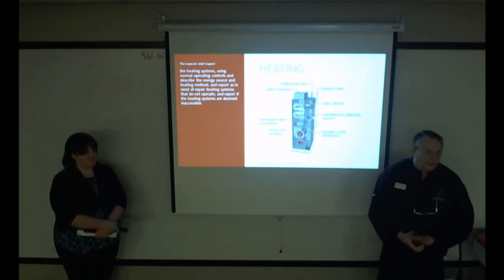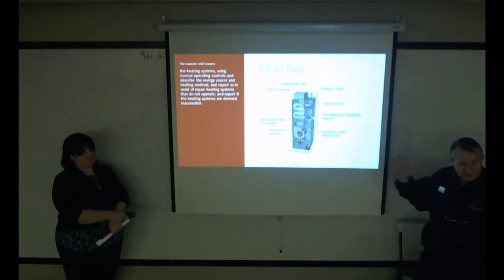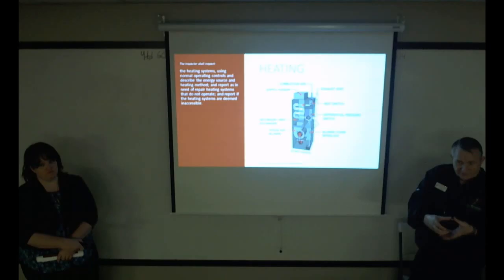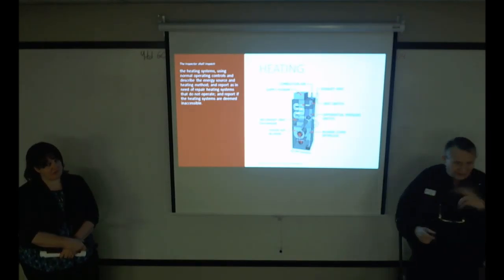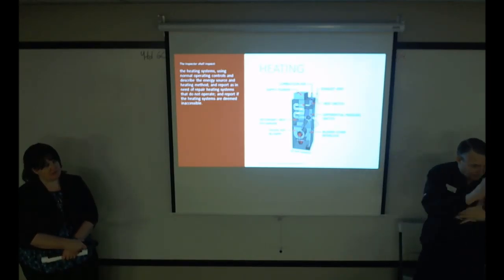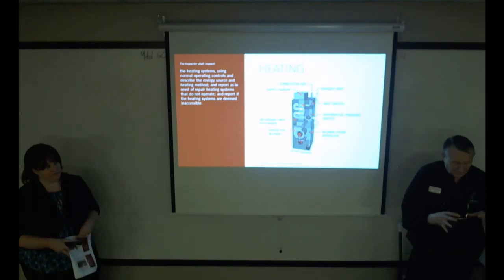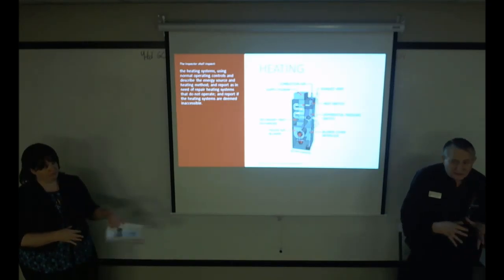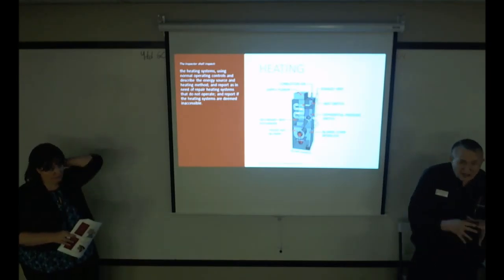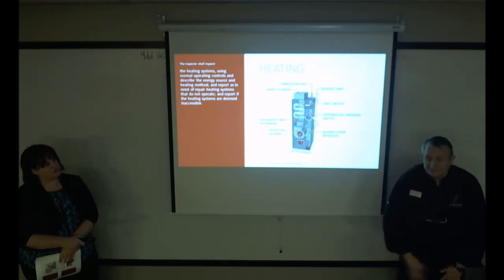What age homes are we talking about? Anything from about 1995 or '96 on — you could have an old gravity-type furnace or the new high-efficiency one. If you see a three-inch flue on a water heater instead of a four-inch, be a little suspicious. You don't need to say anything to your buyers — that's why you hire a home inspector. When the report comes back, don't dismiss it by saying it's been working fine for 30 years.